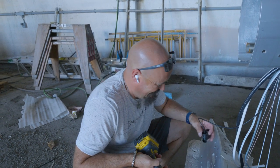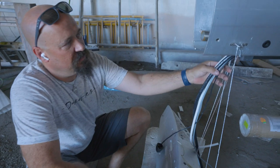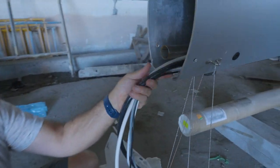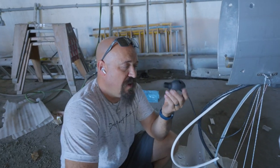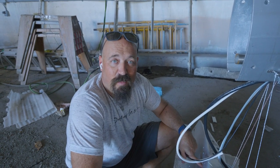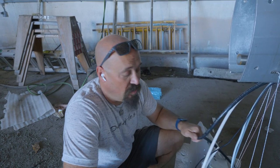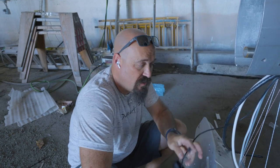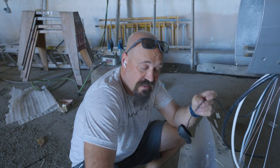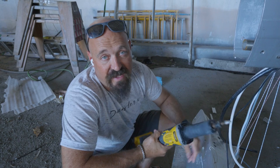What happened was we fed all these wires — look at this big bundle — and it barely fits in that one-inch conduit. Well, this is our air transducer, and I didn't run it through the masthead before I ran it in there. Now I can't get the wire out without pulling all these wires out, and it took us hours to get all these wires in there. So in the effort of expediency, I'm just going to open up the hole in the masthead where all these wires are intended to come through so the head fits through there — I don't want to cut this wire and have a splice 78 feet in the air. So I'm using my die grinder to open it up.